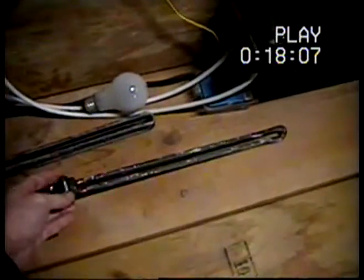The light bulbs are for the dummy load off my charge controller, which I'll probably replace with these water heating elements — they work out a lot better than light bulbs. Inside my battery box I've got the batteries wired the same as before, but I added a little LED light strip I made so there's always light when I open it. There's a switch on the side: when I close the lid the light turns off and a fan turns on to keep airflow going, and vice versa.